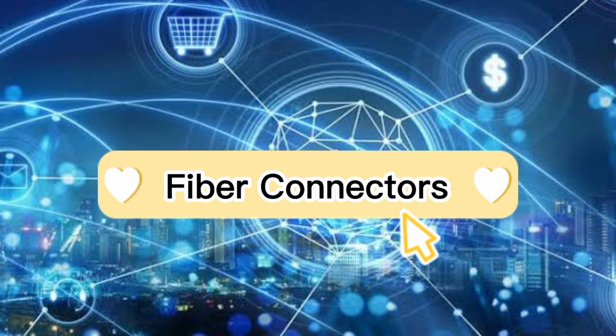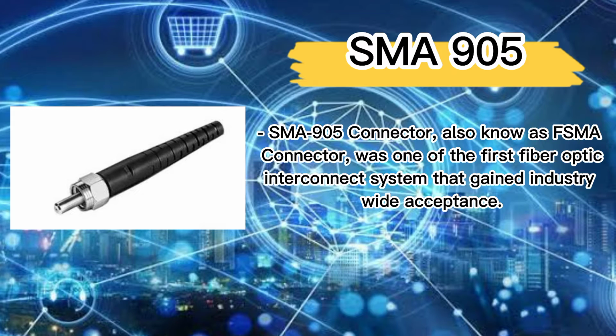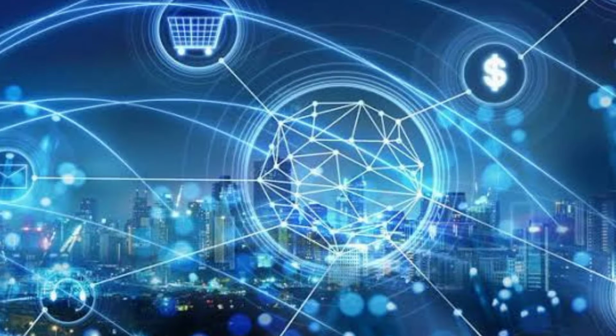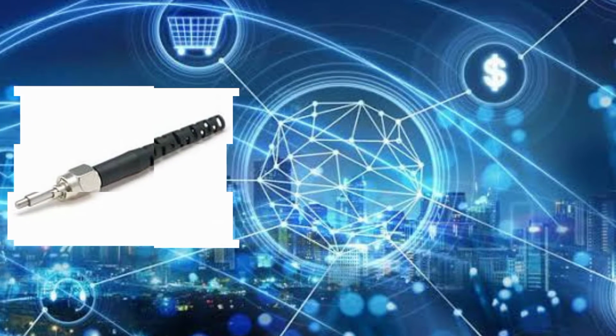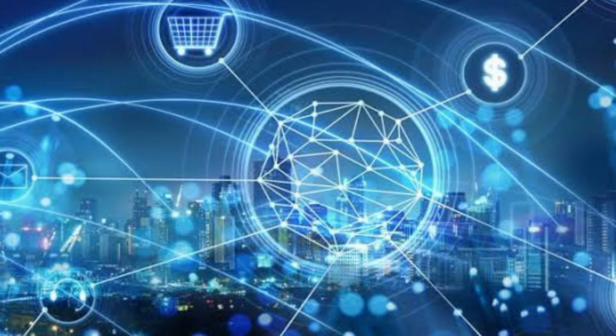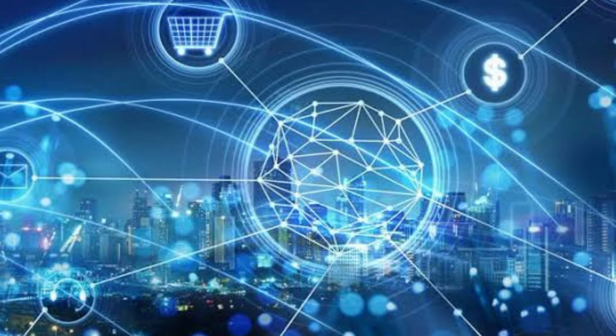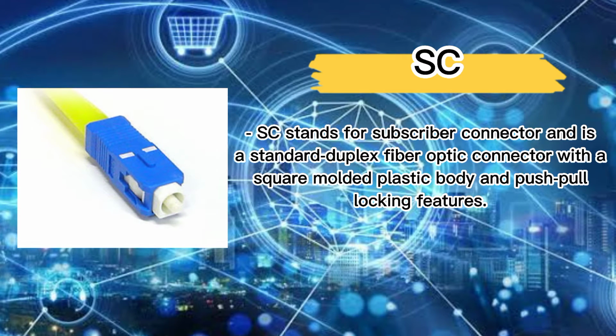Fiber connectors. The SMA 905 connector, also known as the SMA connector, was one of the first fiber optic interconnect systems that gained industry-wide acceptance. SMA 906 multi-mode connectors are available with stainless steel or stainless alloy ferrules. ST stands for straight tip, a high-performance fiber optic connector with round ceramic ferrules and bayonet locking features. SC stands for subscriber connector, a standard duplex fiber optic connector with a square molded plastic body and push-pull locking features.